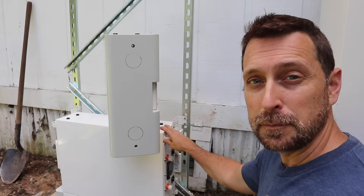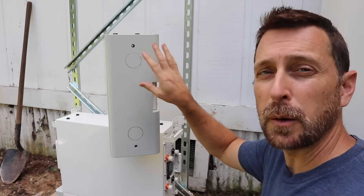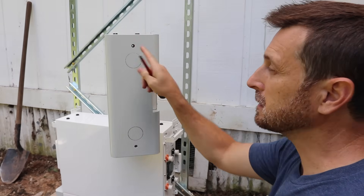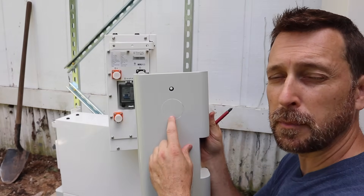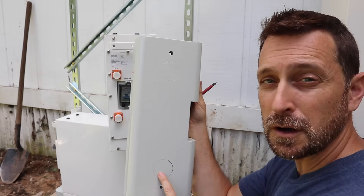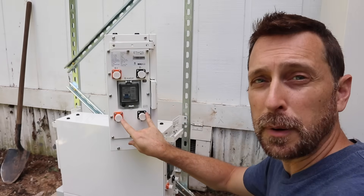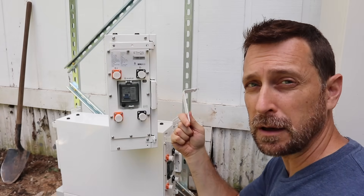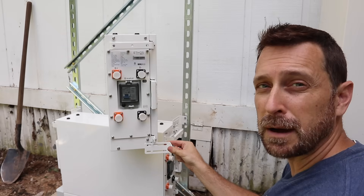We've got our bottom battery in place on our base. When you open your battery out of the package it will have one screw in the top hole — take that screw out and pop off the cover. This is a big upgrade from earlier models which were plastic with lots of vents. The new cover is much more solid with knockouts for conduit. Under the cover you see battery connections for paralleling and the breaker. To connect to the brackets, remove the bottom right back screw — that's where the bracket mounts.